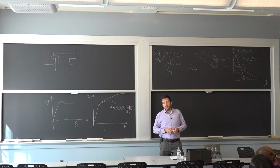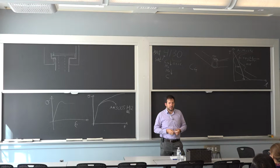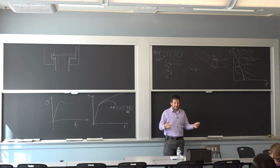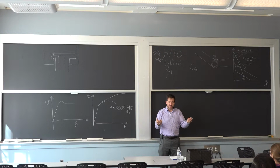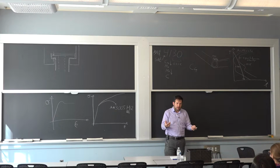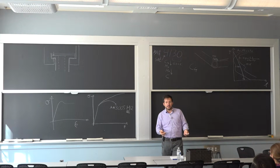So I've done that with respect to the carbon equivalent. When we were working, let's say, on an MBTA connection for the T that was built, they have no records, and they say, can we weld this beam to this beam? So we just took a little sample out of each to do a chemical analysis, and then we were able to arrive at a procedure to do it.